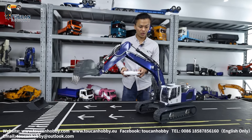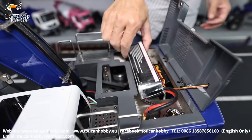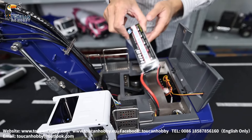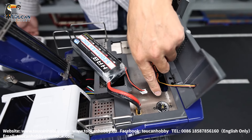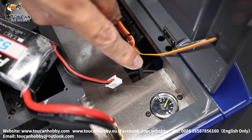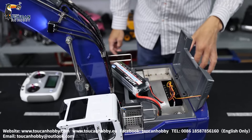We will move back a little and open the cover to see inside. Here we put the battery — you see it still has space. For this one, 5200 mAh — you can even put a bigger one. From here we will be able to see the hydraulic pressure. When I run it, you will see it's a little more than 3 bar. So if the arm reaches the end point, the pressure will be a little more — a little more than 4 bar. So, 80% for the pump motor is enough. No more higher — it's not safe for the hydraulic system.